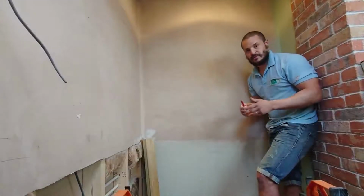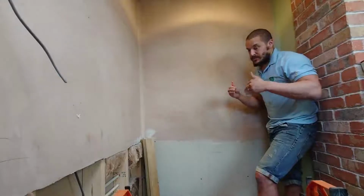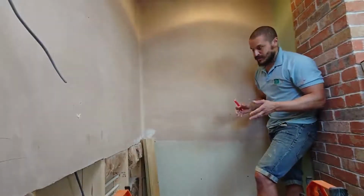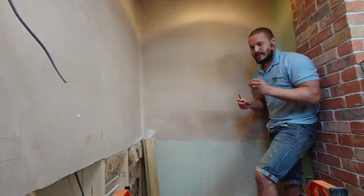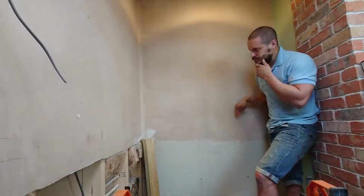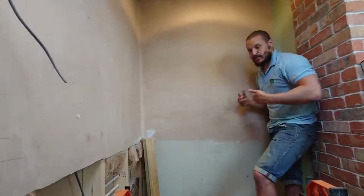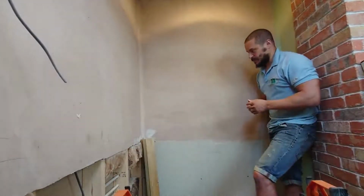One of the products I'll be finishing with is a product called a wedi board. That's my waterproof membrane. There's a few steps before that, but if you search on YouTube for wedi board niche, you'll find plenty of videos. So this is a bit of woodwork, and then finishing off with the waterproof material afterwards. What I might do in between as well is, because I'm going to be using the actual plasterboard and it's not waterproof or water resistant plasterboard, I'll probably paint a membrane on afterwards before I then put any waterproof materials on top of that. But I'll take you through those steps when I get to it.